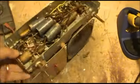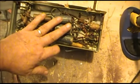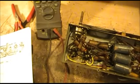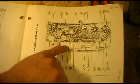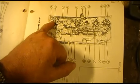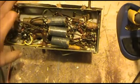Now, the underneath side of this radio has been worked on. These three guys here are replacements. The original electrolytic that would have been in it is shown in Sam's picture of the radio, and it would mount right here. It would have been a cardboard tube with 3 sections, ground coming out this way and the other wires going over to the rectifier tube. Instead, someone has replaced that and taken it out, which I wish they wouldn't have, but it's long gone.